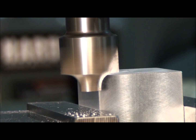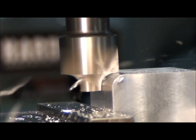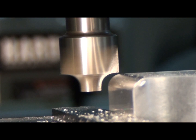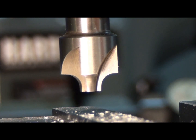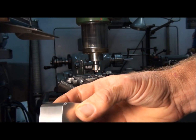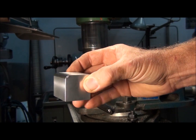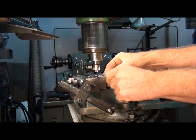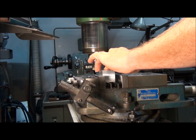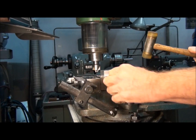Let's bring our table back up to zero and take the cut. You can see — let me zoom out a little bit — it made a nice smooth radius on the corner. Now we can just work our way around. Make sure your part is hammered down every time.